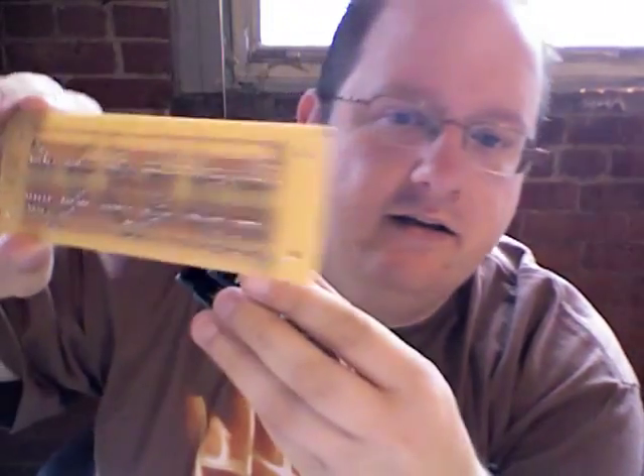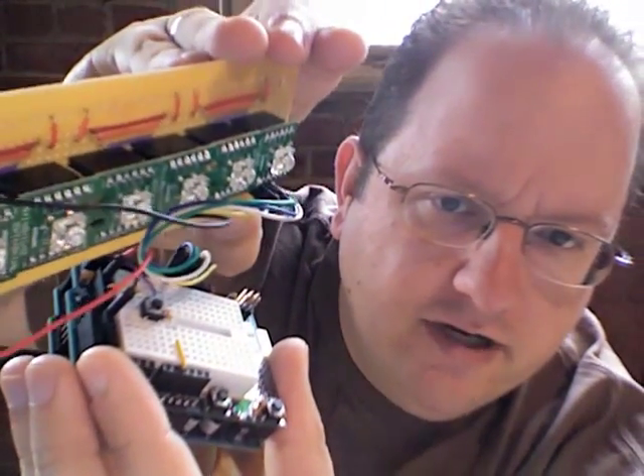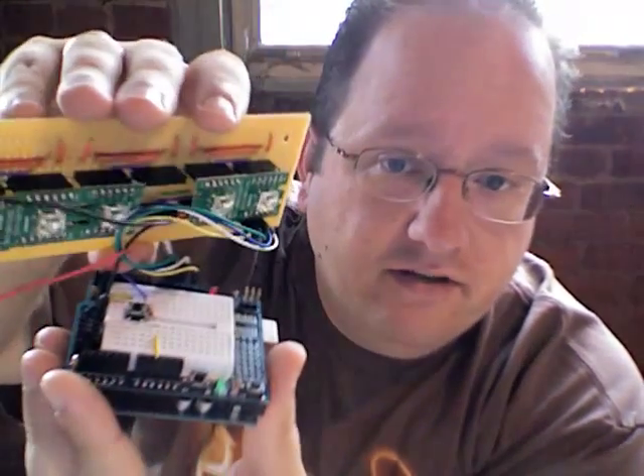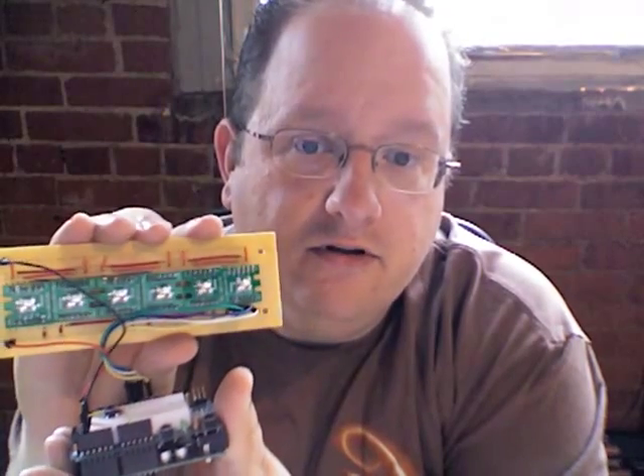I designed this little board myself. It's not much of a design, but you can see that it's all wired up. Each of the shift-brights is connected to the one next to it and to ground and to five volts via the board. I made it so that the shift-brights are removable because they're five bucks a piece, by using some female headers — those I got from SparkFun — and the outputs of one shift-bright chained to the inputs of the next so that you can clock data through them all and then enable them all to show the new thing.